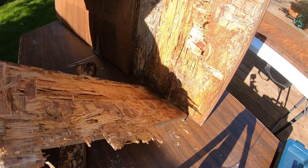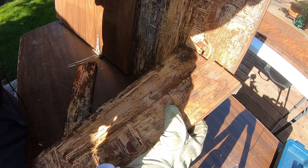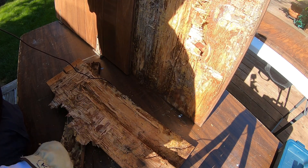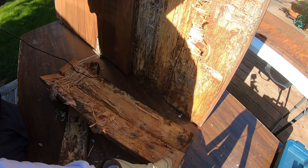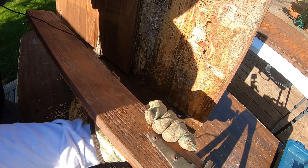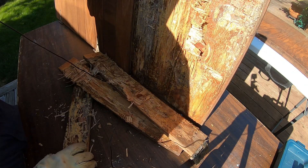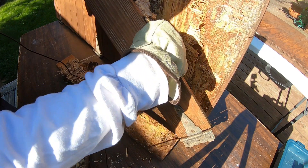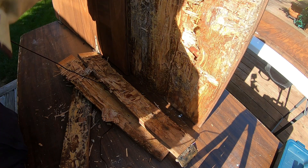You can see how bad this is rotted out. We'll probably sand the back of these boards to make them smooth again — I'll get my orbital sander out to try to get as much of this rotted wood off the back. Because the redwood itself is in good shape, you can see. There's the end grain — it's fine. This is grade A redwood with no knots in it, so this is even harder to get these days. What we used for the deck board was grade B, which has some knots, but this was all grade A. This is like doing furniture with redwood.